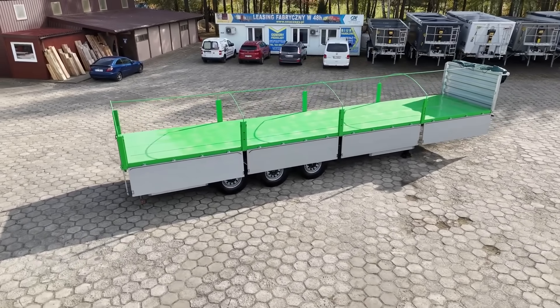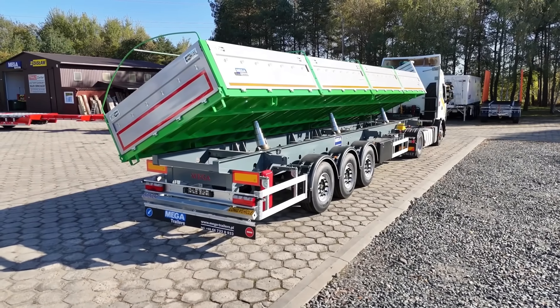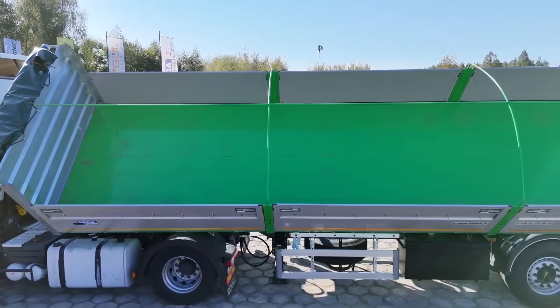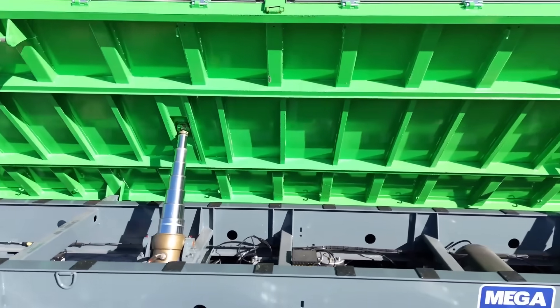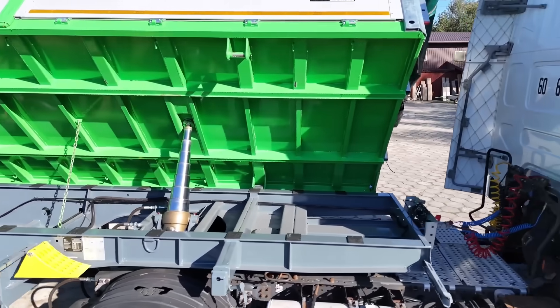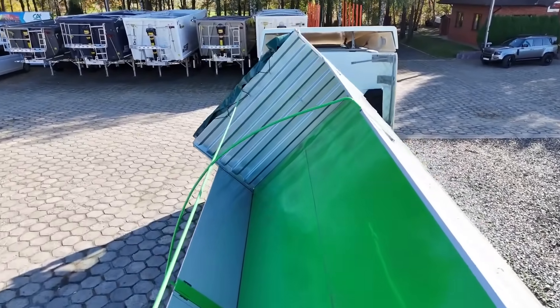It's not about the removable sides or even the liftable axle. This trailer is a tipper, capable of tilting both left and right. This remarkable functionality is achieved through three hydraulic cylinders, each with a pressure of 160 bar. As a result, this trailer isn't just more versatile than most — it can also save significant unloading time in various situations.